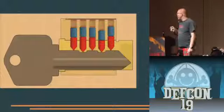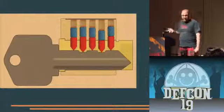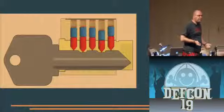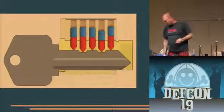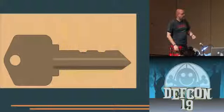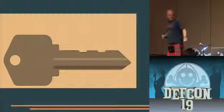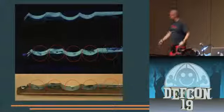That'll stay in place. So if you start wiggling now, on pin number 2 there'll still be a mark, because that was the first one preventing it from turning. But number 4 is now out of play. So another position will start giving dents, because that's the one that's correct. Yep, so other places there get dents. And in the end, you will come up with an awful looking thing like this, but that's a working key.